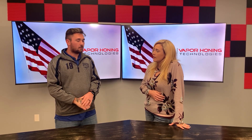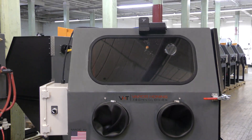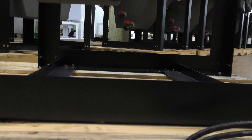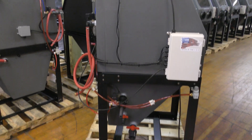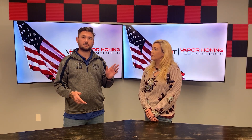We also mentioned an 800 base. Can you tell me about the cool features on that machine? Going from your Weekend Warrior to your 800 base, you're looking at three major differences. The 800 base has a standard regulator, which allows you to regulate your air right from the machine instead of from the compressor. It also has an automatic overflow valve — this runs off a timer to drain the excess water from the internal rinse and the window rinse being added to the hopper, maintaining the proper water-to-media ratio inside the cabinet. And you get an upgraded LED strip light — a two-foot strip light on the top of the cabinet that provides more directional, clear-cut light across the whole cabinet versus the floodlight that sits in the upper left corner.